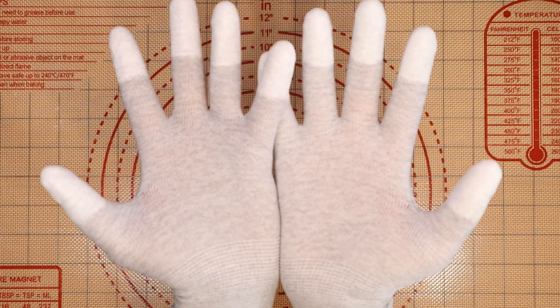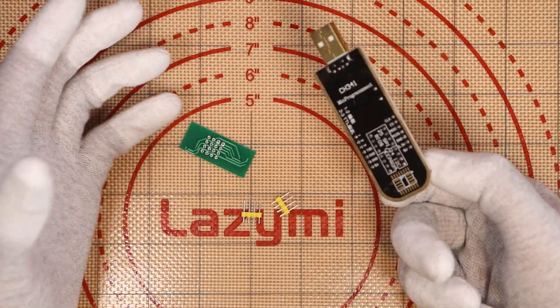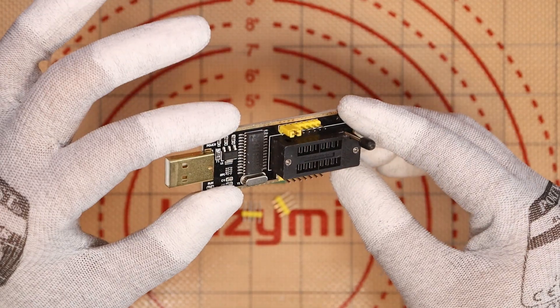All that's left is to get a working digital BIOS chip — which took a couple of days to arrive. I'm not going to go through the whole tutorial of how to do this; you can find that on the Coder's channel and I'll leave a link in the description. I'm basically going to take the BIOS from the console, put it into this little programmer, and make it digital. Cue the montage.